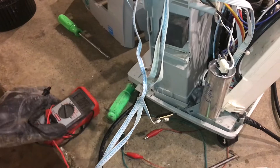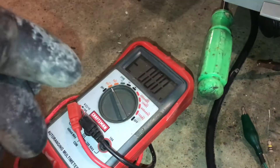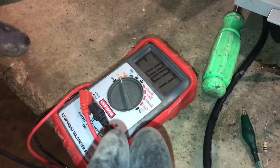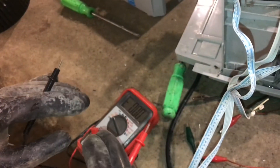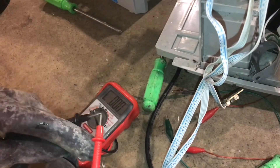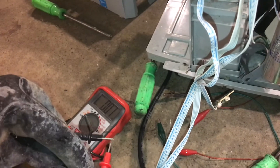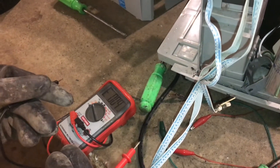For purposes of demonstration, I want to know if there is any voltage beforehand. So I'll put it on volts DC mode. In this mode, the voltmeter has a nearly infinite internal resistance — that is, no current will flow between the two probes. It's in the range of 1 to 10 million ohms depending on the meter. If I cross the probes while touching around, it could spark and make the two weld together, but it shouldn't damage the meter. So let's go to the capacitor.